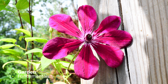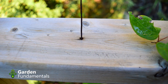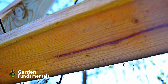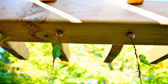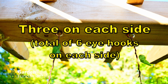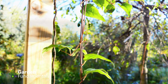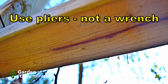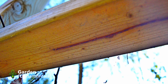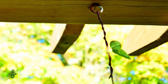I've designed these wires to use a minimum number of eye hooks to give you a fairly tight wiring. The wire starts at an eye hook at the top, goes all the way to the bottom, through the bottom piece, across the bottom, and back up through the bottom piece to the next eye hook. So you have one continuous piece of wire connecting two eye hooks at the top of the beam — I use three of these on this structure. Locate the position you want the eye hooks, drill a pilot hole, put the eye hooks in, attach the wire, run it through the whole system, and attach it to the next eye hook. It's a bit of a tedious process getting the wires through the holes, but it actually goes quite quickly. Once the wire is pulled through the bottom piece, use a wrench to give it a tug — you want that wire as tight as possible. Then bend it across the bottom, up the next hole, and use a wrench again to pull that wire tight underneath the bottom board.